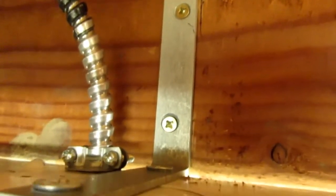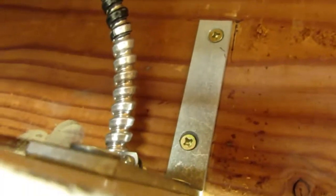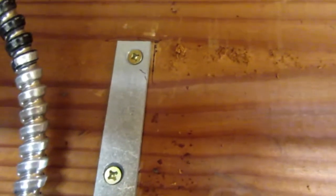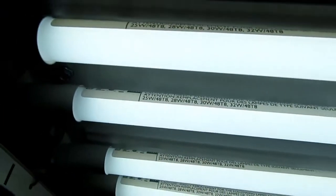I've got them all mounted using just an angle bracket screwed into the fixture — I did use washers on the inside because of the thin metal — and then deck screws into the floor joists above. Since the ceiling is low, there's very little clearance between the floor joists and the suspended ceiling frame, just barely enough to fit these fixtures up there. This method is easy and holds them nice and firm. I've got them wired in with MC-style armored cable.